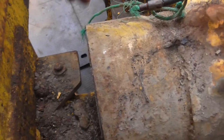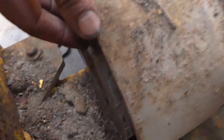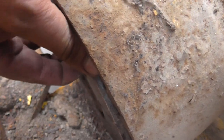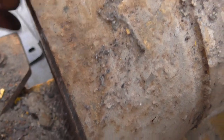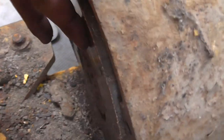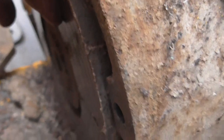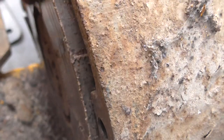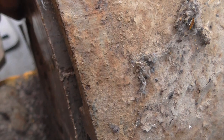Independent brakes on the GCB in there. That is the disc — it's a friction disc which is stuck on the splines. It moves, but it's stuck on the splines. It is very smooth and rock-hard. There's not much left on it — the rivets are almost flush.